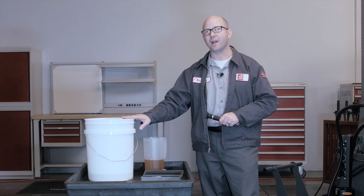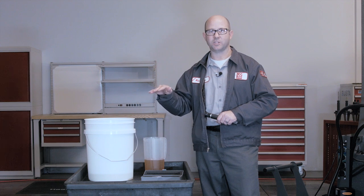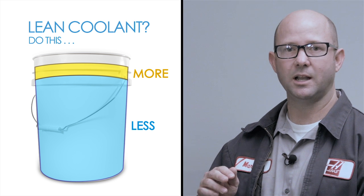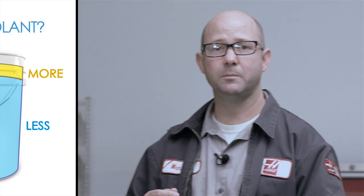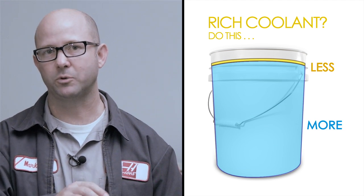A little while ago we showed you how to fill up the coolant tank using just a bucket of water and a quart of concentrate. Those five gallon buckets mixed at 5% concentration are a kind of baseline for the coolant concentration we need for our machines. So if the concentration level is low, say 2%, you'll need to compensate by adding buckets that have extra concentrate and maybe a little less water. This same estimate method can be used on machines that have higher coolant concentrations — say our machine is at 10%, we need to cut that rich coolant by adding buckets that are mainly water with maybe just a splash of coolant.